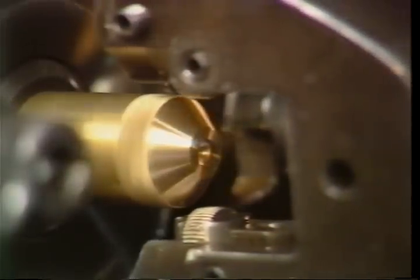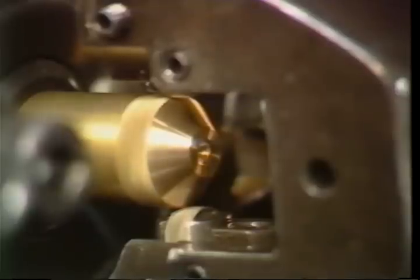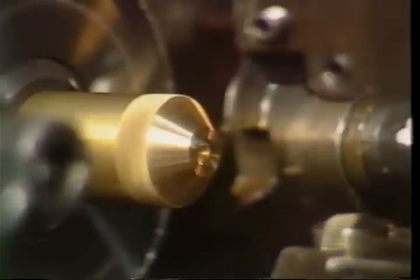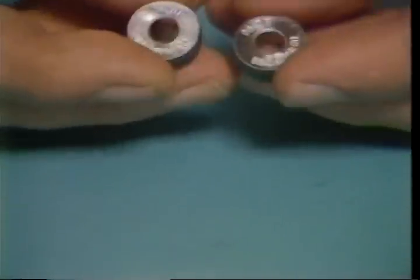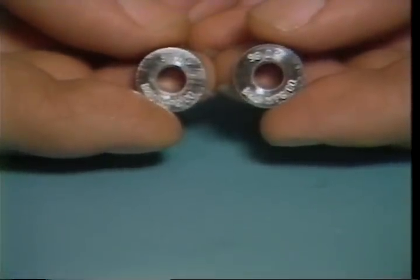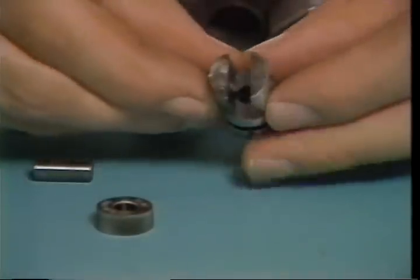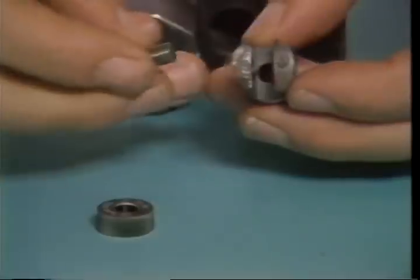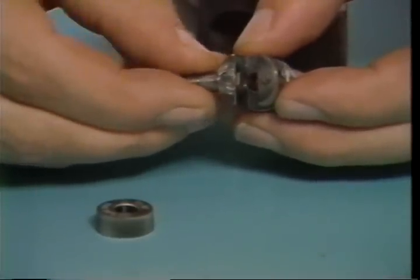This television training tape will show you how to adjust and mount the adjustable knurl holder for straight knurling. Preliminary setup for knurling can be accomplished on a bench surface. Select the proper pitch knurl rollers in a match set. Mount the rollers to the slot in the holder and insert the roll pins. Be sure the flat on the roll pin will be seated against the holding screw when tightened.